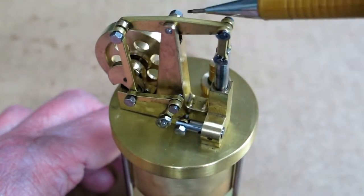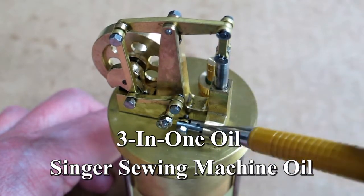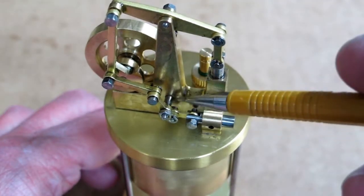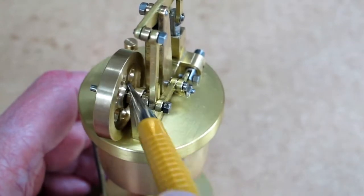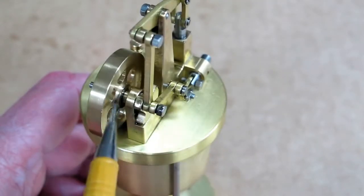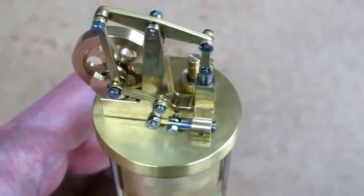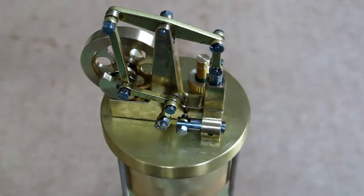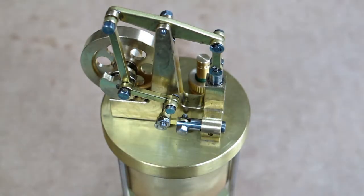You want to put oil on all of these pivot points. I put a little bit on the power piston and on the valve. Anything that wiggles or turns — there's a stationary pivot here. And on the axle for the flywheel and the counterbalance, I put a little bit of oil here and here. Then turn it and do that before every run. Oil's cheap. You oil this before every run and don't run this thing too fast — it will last you a long time.